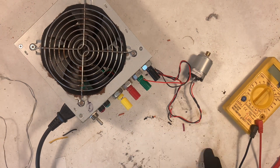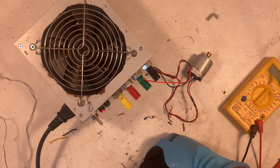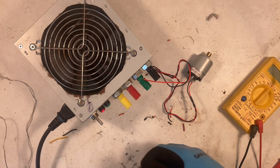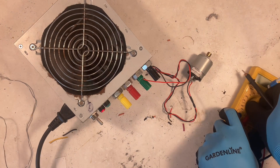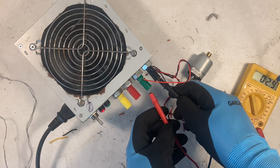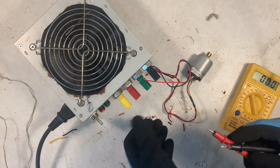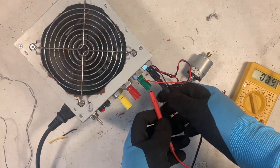This is where it got really weird. I've been testing for about five minutes and the only voltage I was getting out was 5 volt from where the 3.3 volt was supposed to be coming out. And for some reason the switch didn't work either, so I gave it a little nudge and eventually it starts working — it spun up to life. I genuinely have no clue why this is working. One theory is that the USB output keeps charging even while the power supply is off, but that wouldn't explain why the switch doesn't work or why touching the yellow contact made it start working again. I thought it was a loose connection at first but I'm starting to doubt that. After that it was working fine — I've used it for a good three hours to test stuff with no other problems. Can someone please in the comments tell me why that happened?